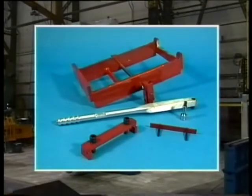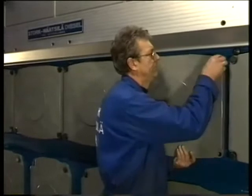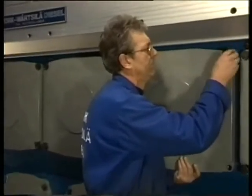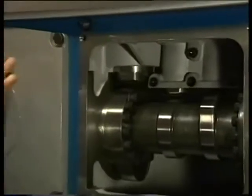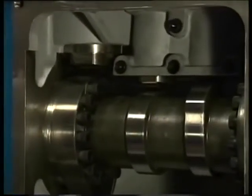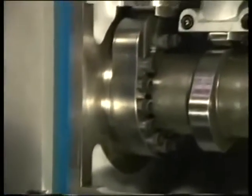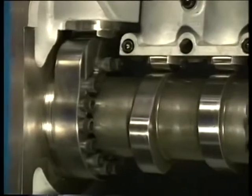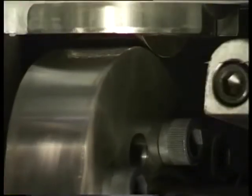Also needed are the following tools, which are delivered standard with the engine. Begin with opening the camshaft space of the relevant cylinder. After that, the fuel cam is being turned into top position of the compression stroke so that the fuel roller is lifted as far as possible in order to block it.